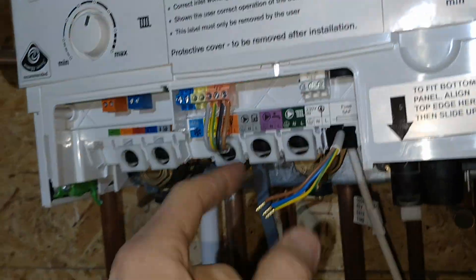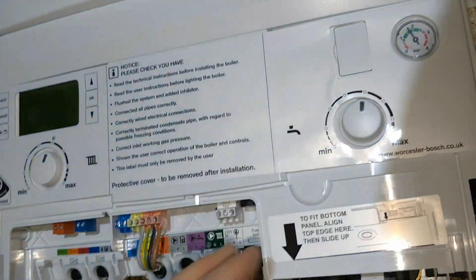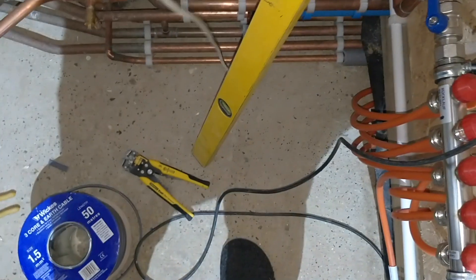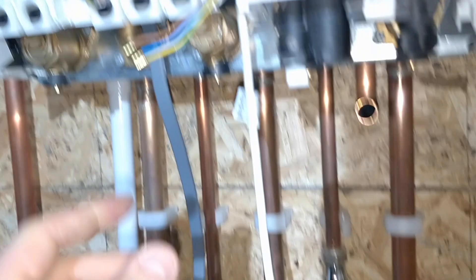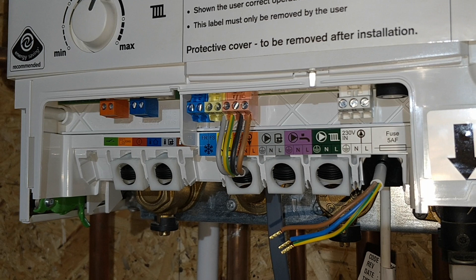If I cut the old plug cable off and something doesn't work, I'd have no way of powering the boiler, so at least with the plug I've got an option to run the boiler as-is. I'll leave it unplugged and loose for now and neaten it up afterwards. It's also worth pointing out that I put brown sleeving over the gray switch wire — all switch live cables need sleeving to indicate they can be live. I put the brown sleeving on both sides of the switch live after testing and confirming it was working fine, so that indication is there for anyone else who opens up the boiler.